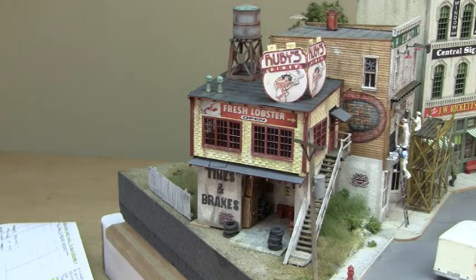Now, these shingles are self-stick on this one? These are self-stick. And paper loves paper, so basically you're dealing with two paper products, so they're going to stick very, very well. Just be careful to get them as straight as you can on your courses. This is a sawtooth shingle. It takes a little bit more time than a regular shingle because it doesn't cover as much. But when you're done, you've got a great, different looking shingle.